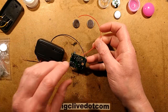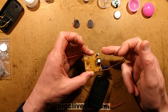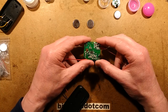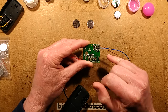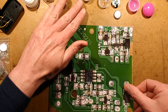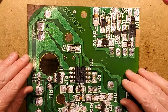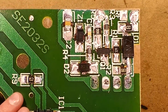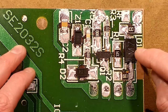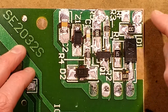The circuitry is spectacularly optimized. On this side of the circuit board it's got the transformer, an electrolytic capacitor for the low voltage side, and the two LEDs. On the other side it's got the switch-mode power supply, which is based on a single transistor. The switch-mode supply uses just a single rectifier diode with no smoothing capacitor, so it only rides one half of the sine wave and switches during that portion.